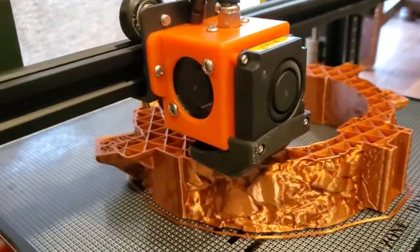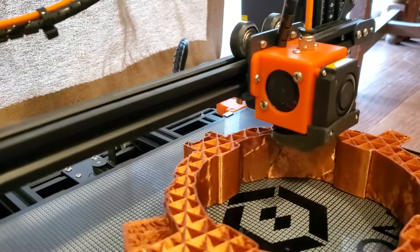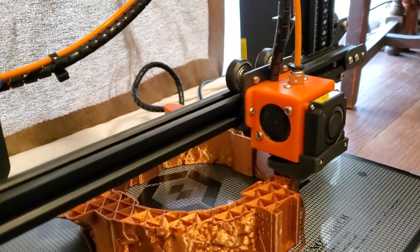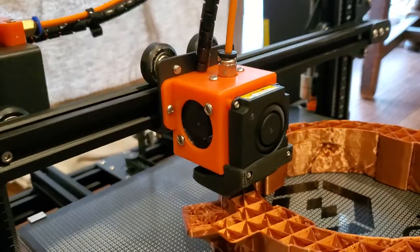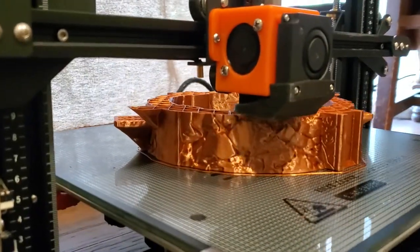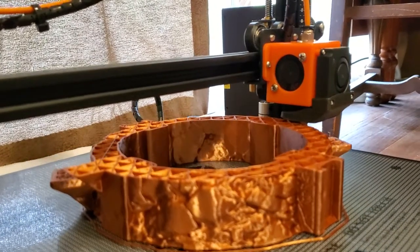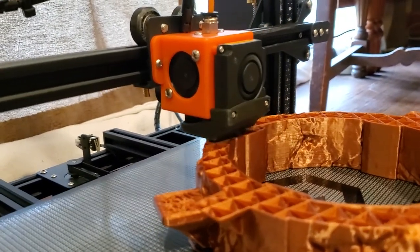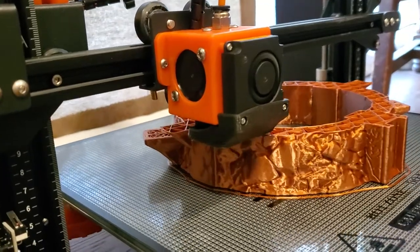Another very functional upgrade that I printed — and you'll get to see it in motion — is the fan shroud on the bottom of the hot end of the extruder assembly. This is much better than the stock fan director, which very interestingly directs the fan exhaust kind of down at the build plate instead of across the nozzle. This upgrade does a really nice job of circling around the nozzle and directing the exhaust to multiple angles and multiple axes towards the extruder nozzle, and it just works better. I've been able to actually tweak my temperature through temperature towers, and it's just doing better overall as a result of getting better cooling to the nozzle.